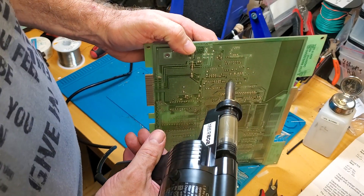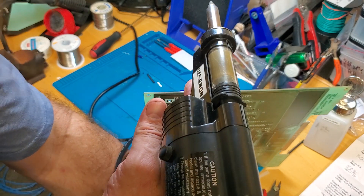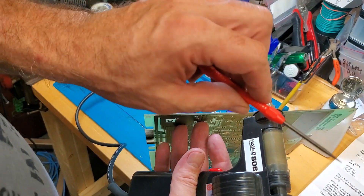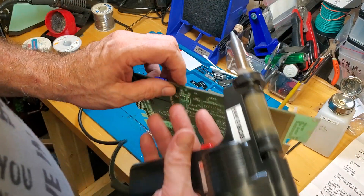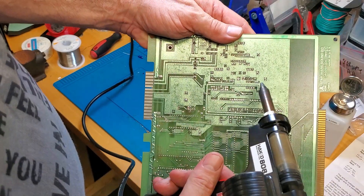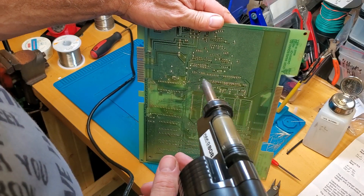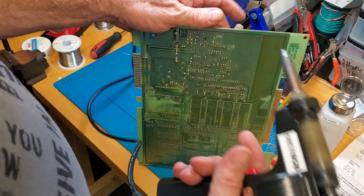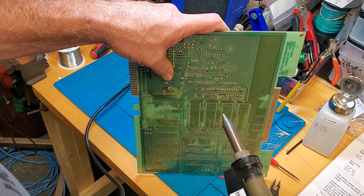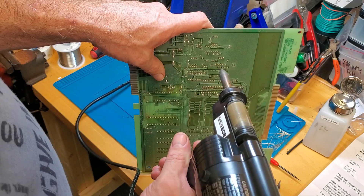If you don't have a nice clean hole, you can use a reaming tool to open the hole very delicately. I prefer that over hitting it with the soldering iron again, because the more you apply heat with the desoldering or soldering iron, the more likely you are to blow or burn the pads. These little pads are attached to the board and if you apply too much heat for too long they can lift off, leaving you with damaged traces you have to work around.